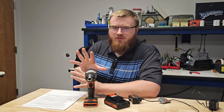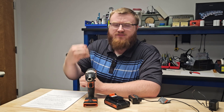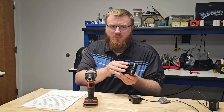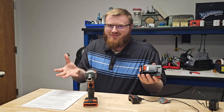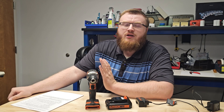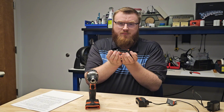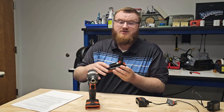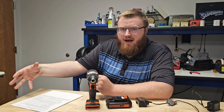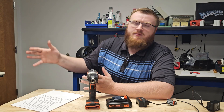UN 38.3 is the only mandatory standard in the United States, and it is not a rigorous electrical safety standard — it is a transportation standard. So are drill batteries safe? Will they burn my house down? My answer is: yes, in general, drill batteries are safe. Transport testing is not a good measure of safety for consumer or industrial use. Standards like IEC 62133 or the UL standards are much better at addressing that. But as far as the pack being safe — I have Craftsman batteries at my own house. I charge them in my own house and use them there.